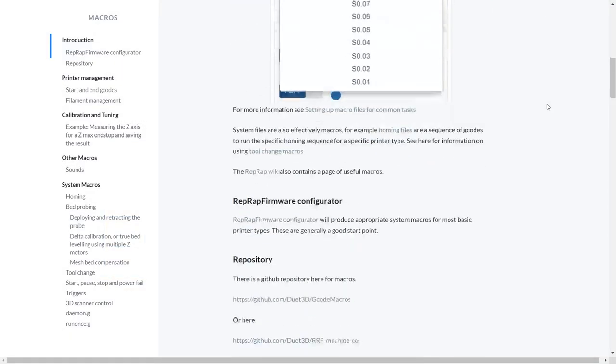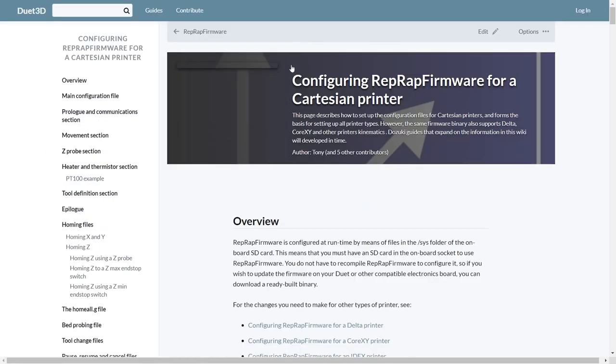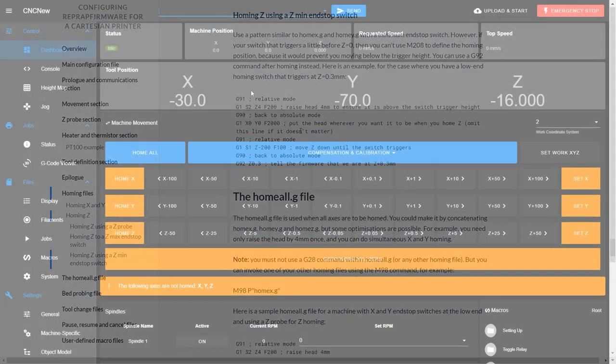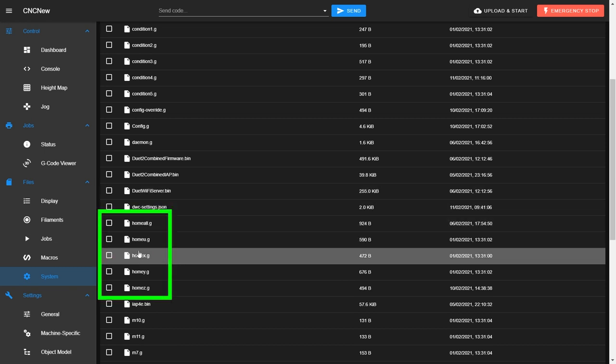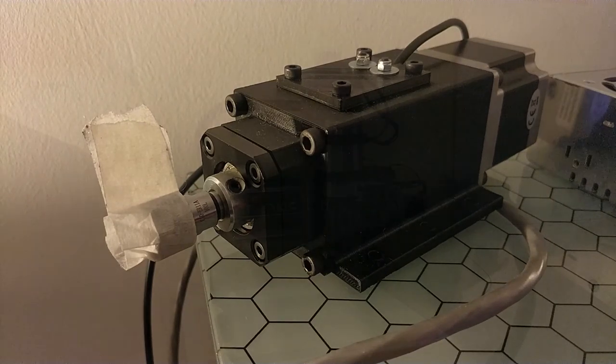To home your axes, you'll need the relevant firmware macro .g files in the system directory, the full list of which can be found at the Duet3D website, which I'll link to in the description. The files called when homing include homeall.g, homex.g, homey.g, and homez.g. I also have a homeu.g for my tangential knife, which I'm still working on.